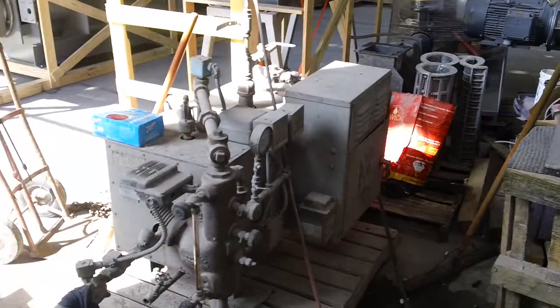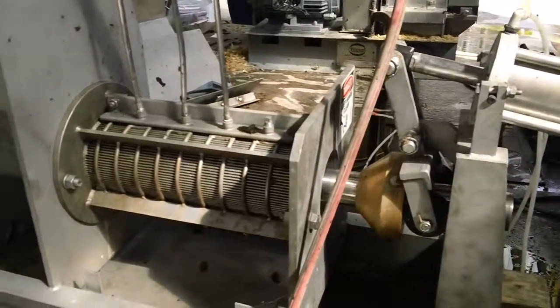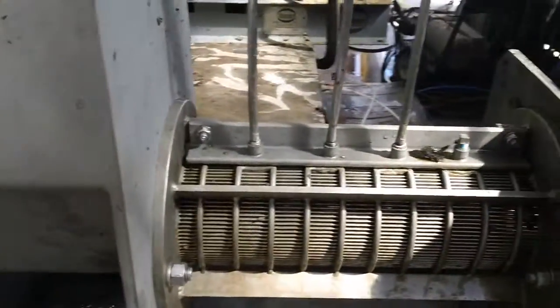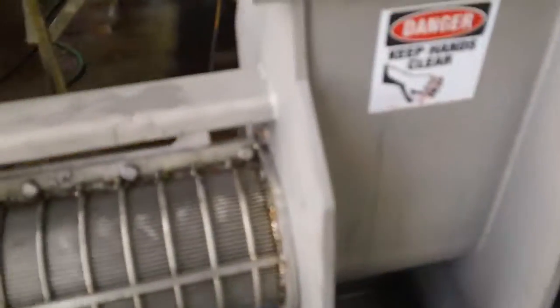That red line runs over to a very old steam boiler that we have. By injecting steam into product, it helps release some additional moisture. Don't know if that would be practical in your setup — you would probably need waste heat steam — but just to point it out as a technical reality if it would assist.